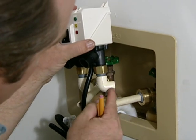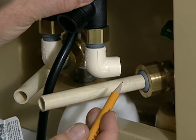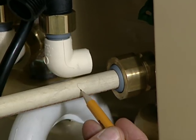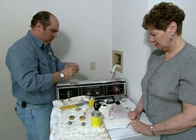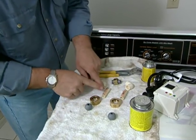A fitting has a given distance that it can accept for the pipe, and you'll see it's about there. So now when I hold this against the wall, I want to transfer that mark right here, and the same on the other side. Here are the two pieces that I cut, and here are the connections we need to make.